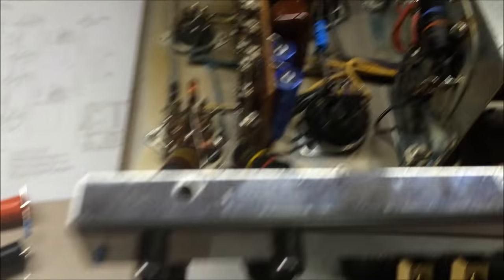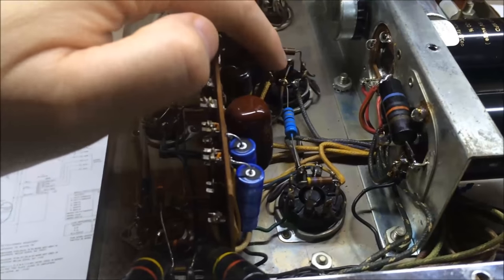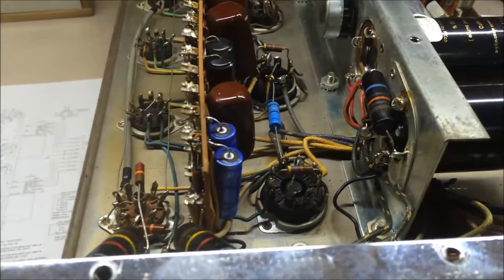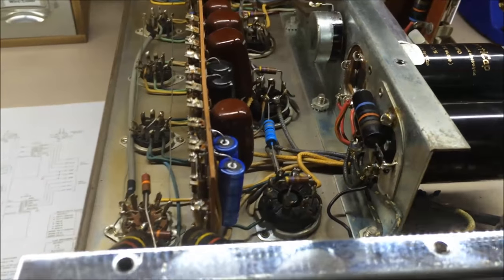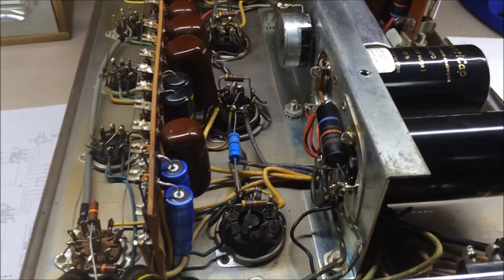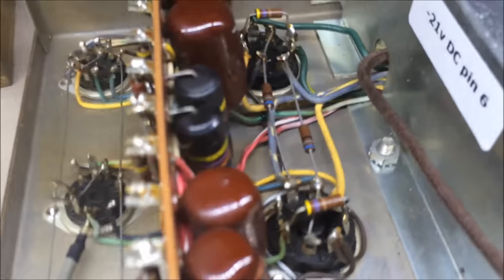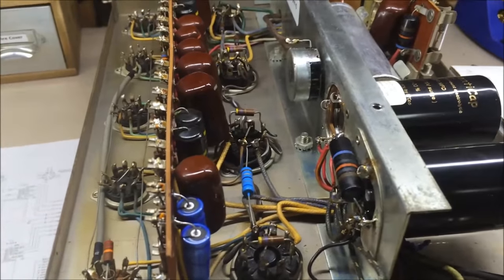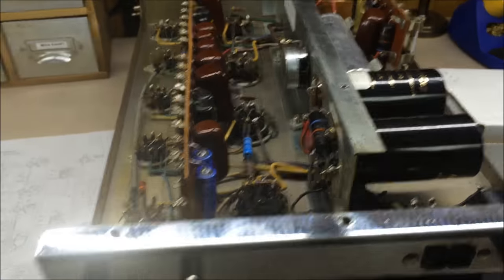One of the things we noticed when I got into this amp was that at some point I had replaced these screen resistors. They basically go from pin three of one of the 7591s into pin four of the other, which is grid two or otherwise known as the screen. When a tube goes out, a good bit of the time it blows this resistor. These resistors from the factory are probably quarter-watt resistors, originally designed to blow instead of affecting the transformers themselves.